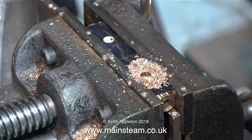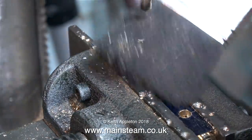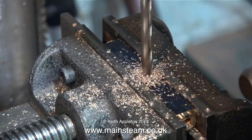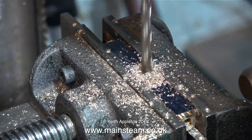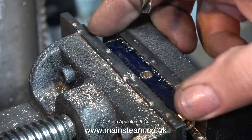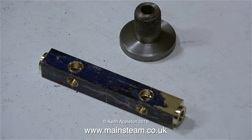In case you're wondering why I only centre drilled this part initially, that's because I didn't want to drill all the way through, because what would happen is as the drill went down the centre and met the cross holes, there's a good chance it would foul up and break off. Initially I used the 7/32nds of an inch drill to drill all the holes tapping size for quarter by 40, but I drilled the two holes underneath the crossbar with a quarter inch drill to locate the columns. The quarter inch diameter holes are uppermost in this image.